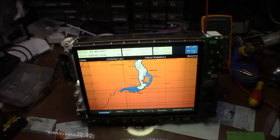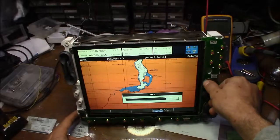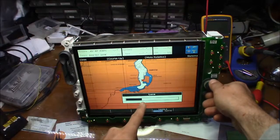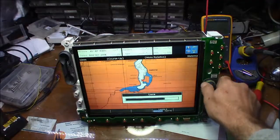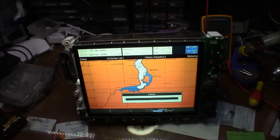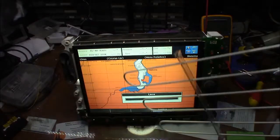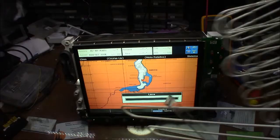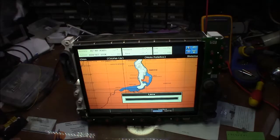It used to be like this and until now nothing special. We have the backlight that can be adjusted from the original menu. Now here you see a point where it's just going not linear anymore. That is because inside the Raymarine we don't have the CCFL lamps anymore — I took them out and threw them away. I'm about four or five years into taking out CCFL lighting from the Raymarines, because they are known by now to be failing.